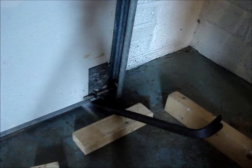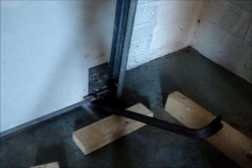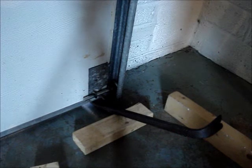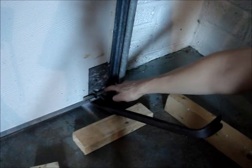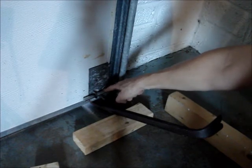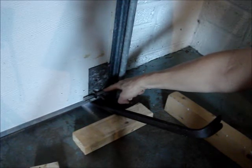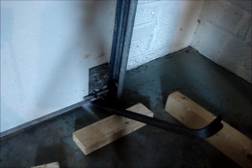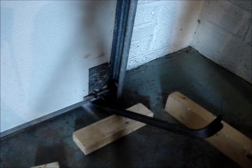The next step is to lift the door so the scale can be slid under the door to weigh the full weight of the door. Raise the door by putting a pry bar under the roller at the track at the bottom of the door. Don't pry anywhere else on the door — if it's a steel door, you could warp or bend it.